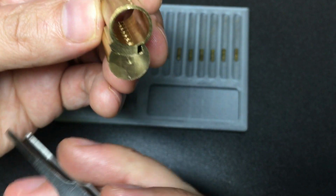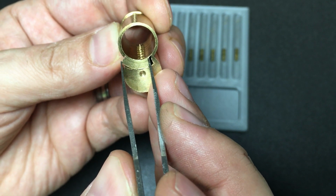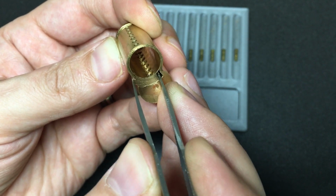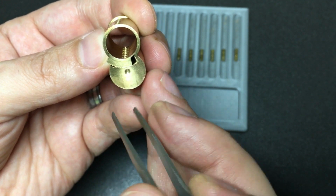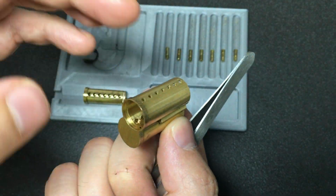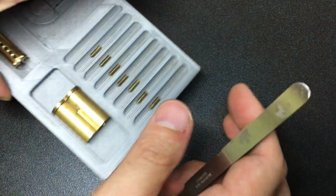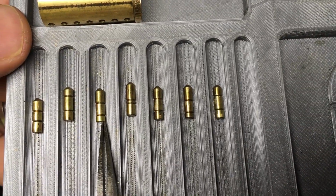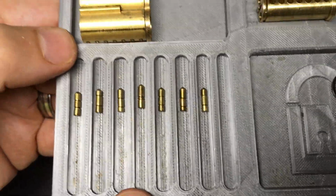So what you need to do is engage with this moving latch here without the pins going too far and oversetting. So yeah, I'm sure there's many better videos to explain how these SFIC cores work, but there you go. So yeah, it's one of these locks which is very unpredictable. I've had 10-minute picking times, I've had 2-minute picking times, and it's all to do with these bevels on the pins. We got lucky this time, apart from springing one of the wafers out, but the worst is to come.